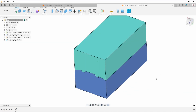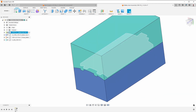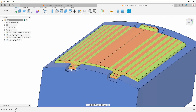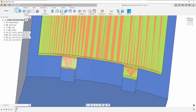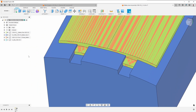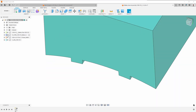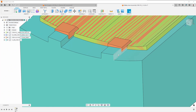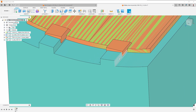This is the section of the mold of interest — it's actually two inserts, and you can see there are some holes there for that. I'm going to hide the top, which is this part here. You can see right here is where we have the tabs for the battery door. They need to be a little bit wider, so this side looks no problem. But if we look at the other side, this is where we start to run into the problem. This is the shutoff, and to deal with the wider tabs, we would have to make this wider.